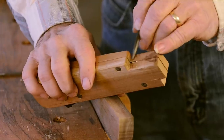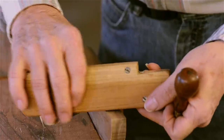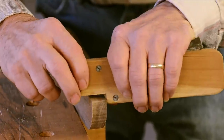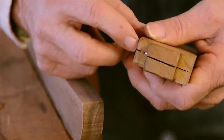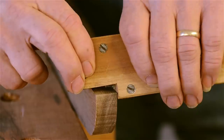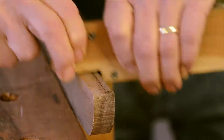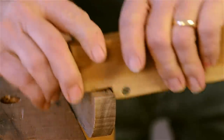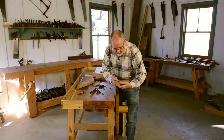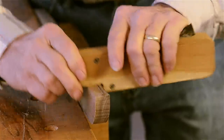We filed the shape into the piece of sheet metal and I've got it clamped in place now, held by the tension of these three screws. It's just projecting enough, and I'll hold the corner of this notch — what acts as the fence — against the side of the stock, using downward pressure and a slight inclination of the cutter, and let me start scratching. These are nice in that they cut in both directions. We filed that shape square across so it doesn't really care whether you're pushing or pulling on it to get it to cut.